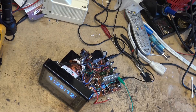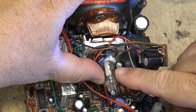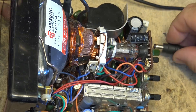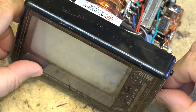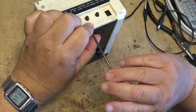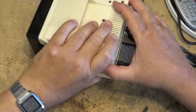Definitely not the smallest CRT made, but certainly small - look at the size of that little gun. I think the smaller tubes probably had about the same size neck on them. Let's plug this thing in and see whether it powers up with the power switch connected again. It looks like it's working - maybe just adjust the centering here a bit with the centering magnets. One screw to hold it together - good enough. I think it takes a while to warm up. Thanks for watching, we'll catch you in the next one.